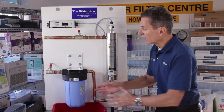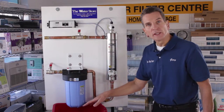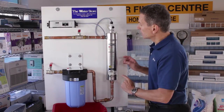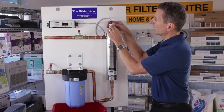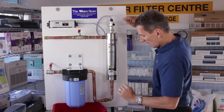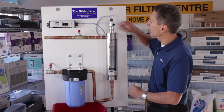The next step is to undo the filter housing — unscrew it — and that will drain all the water out of the lower portion of the system. Then you need to remove the bulb and the glass sleeve. It's powered down now, so you can undo this nut at the top and you'll see the whole unit pops up because there's a spring inside. You can't touch the ultraviolet light bulb itself — the glass portion — but you can touch the ceramic ends.